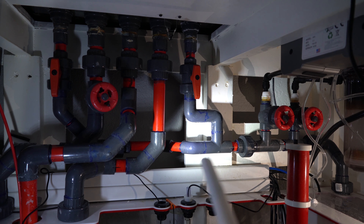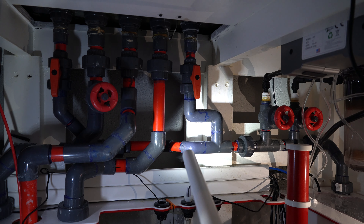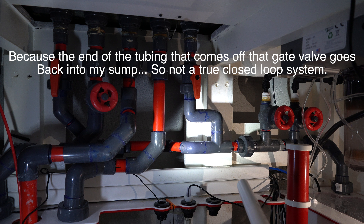I've got a union here and a union right here, and these are actually screwed in up top. My plan is to tie into these unions and not actually cut any pipe. My reasoning is that if I have a leak or want to go back to this setup, I'm able to do that. This is the lifeline to my tank — if I mess something up cutting into the plumbing and it takes a day to get it fixed, that's a day without cycling water causing instability. So I want to have it shut off for the least amount of time possible.